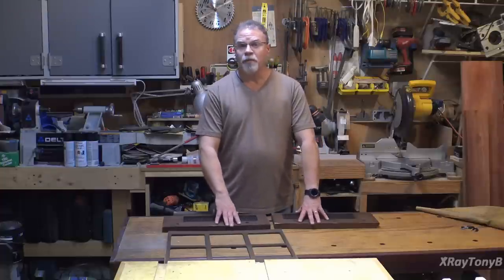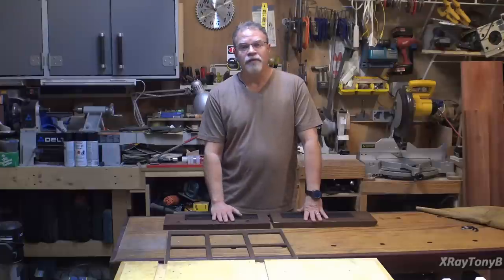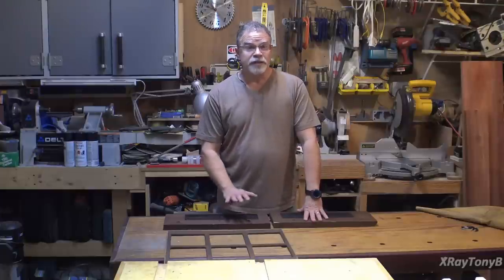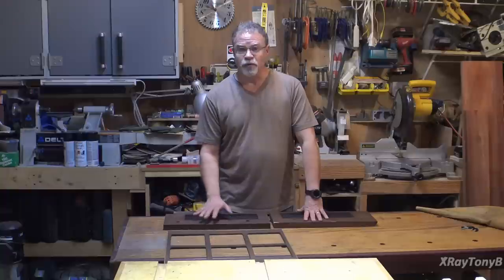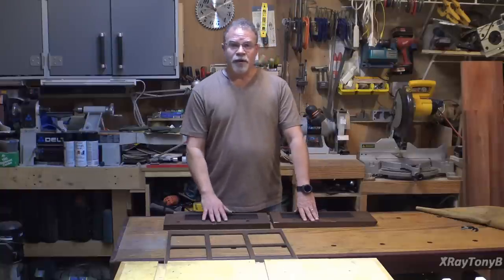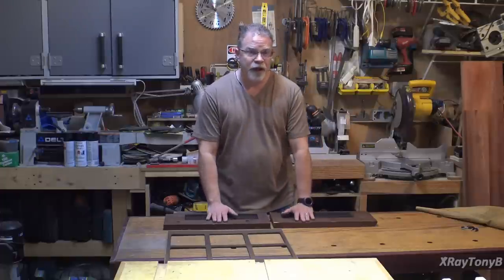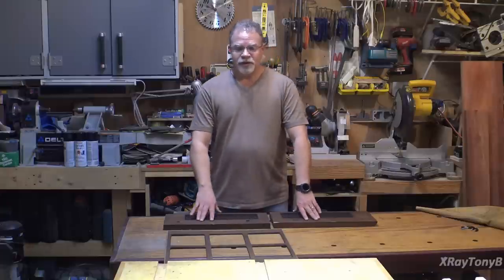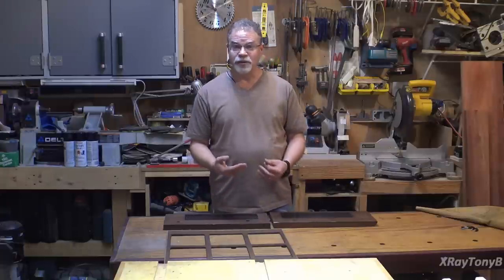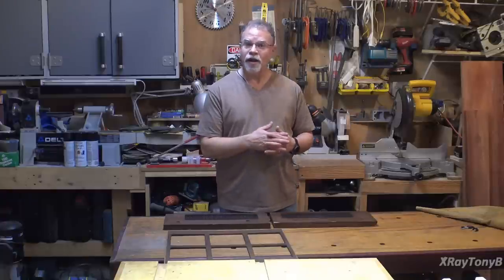I did have someone who is an owner who is about to do a restoration on his 2500, and he claims he has an unmolested unit, to the best of my understanding, that has not been serviced, nothing has been moved around in it, and lo and behold, it actually has that same slight hum problem. So from the factory, there is a possibility that some of these may have come out with a slight hum problem. So that's something that we're going to look into a little bit more, to see some of the things that can cause that.